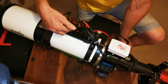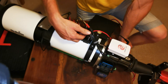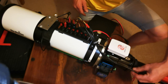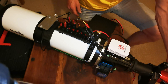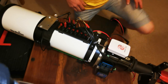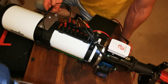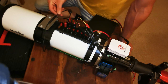Those two are the two 5-volt outlets and I've got the two 12-volt outlets - one to the focus cube just here, and another one just running along the focus draw to the back of the astro camera. And at the front here I've just got one DC going into the large dew strap which is just there, and that just tucks underneath my handmade mounting bracket.